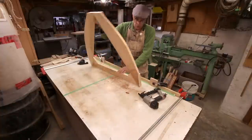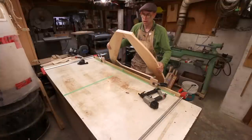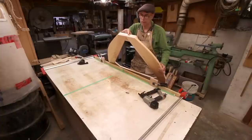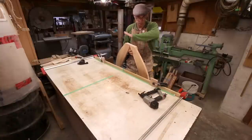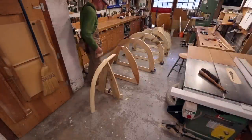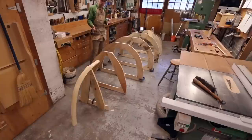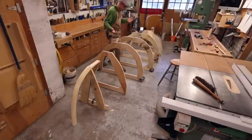That's all there is to it — we are ready to set these up on a strong back. A few of these are a little bit funny right at the joint because of course you're making them in pairs and sometimes you don't get things 100% accurate. I'm not going to worry about it too much. With all these molds done we can get a sneak peek of what our boat looks like, and that's really exciting. It's kind of cool to get a sense of the volume — this is the first time you really get a sense of it. You think you do when you're lofting, but you're only ever seeing half the boat.